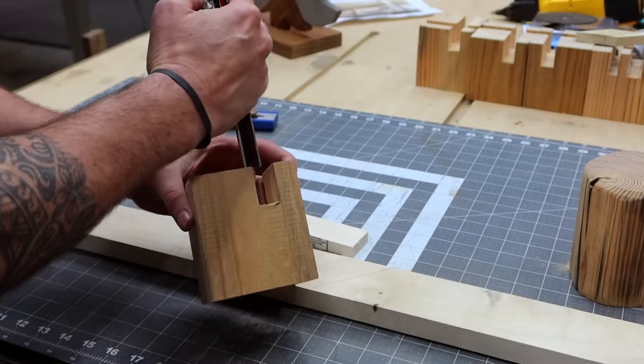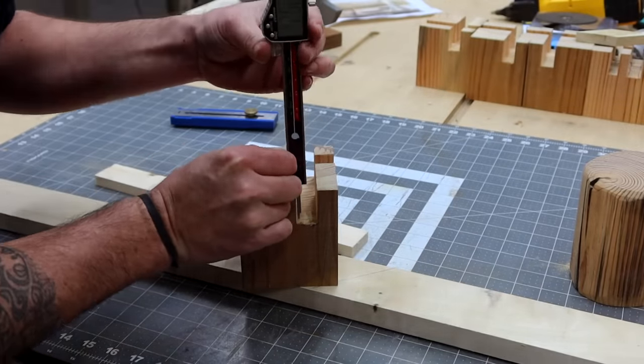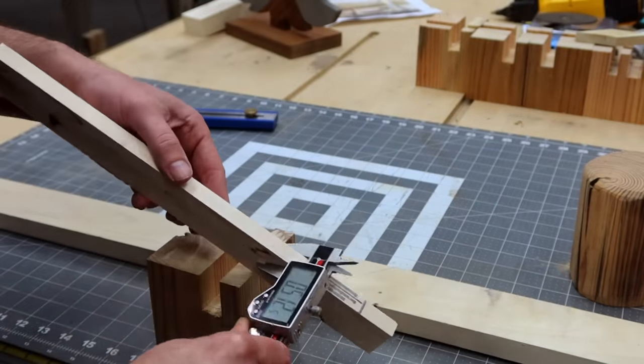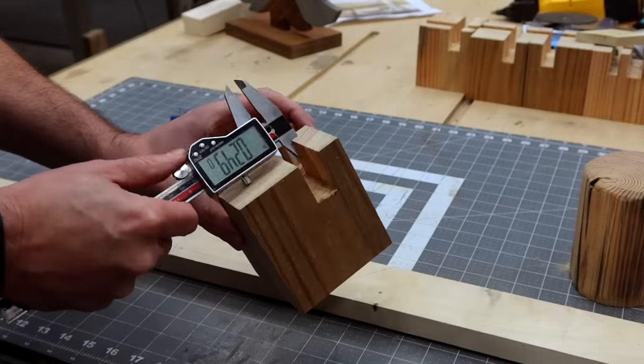Now let's talk about some digital products. First is digital calipers, and yes you can pick up a nice set for less than $20. Calipers can be used for all kinds of different things, not just in millwork. Whenever you need to know exact thicknesses — say an odd thickness — you can find it, lock it down, and transfer it over. You can use the bottom to take measurements in places other tools can't reach. These can measure the outer diameter as well as the inner diameter of about anything up to six inches. Very handy for identifying missing bolts or hardware by measuring the ID of a hole or OD of an existing bolt.